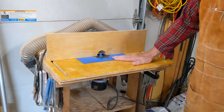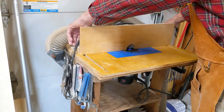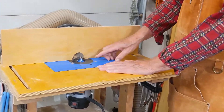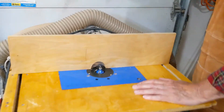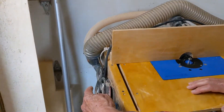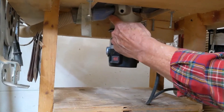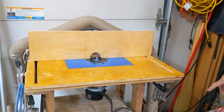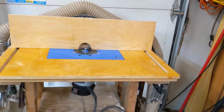This is my router table with a router built in, and I have an adjustable fence that just slides back and forth. Since this video is about dust collection, I want to let you know that I made this fence. If you look down on top, you can see that we have a dust port here, and there's a hose that goes around and over on the right side — that's connected underneath to a hose that sucks the dust in and pulls it right down through this hole. It's very effective at sucking dust in because I've got a dedicated shop vac pulling in all the vacuum. I get very, very little dust when using this device.